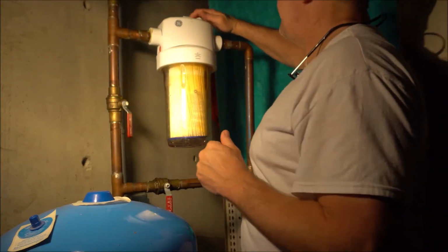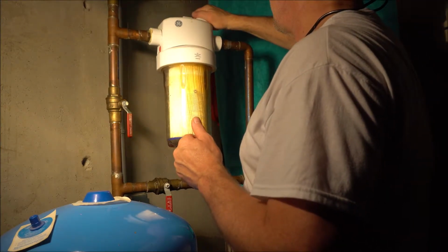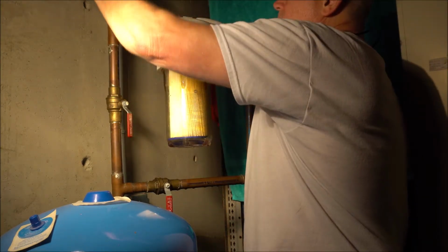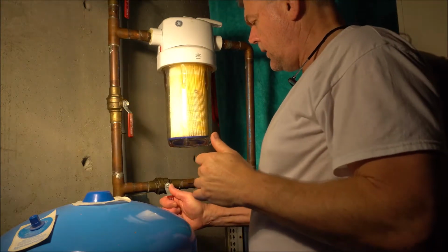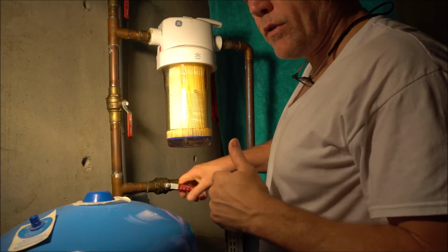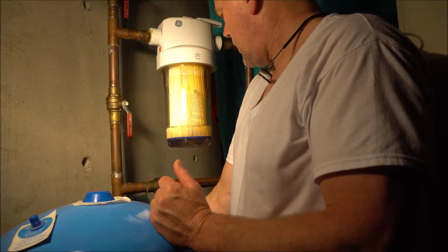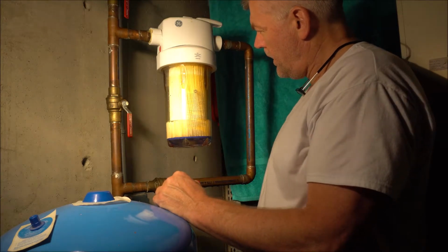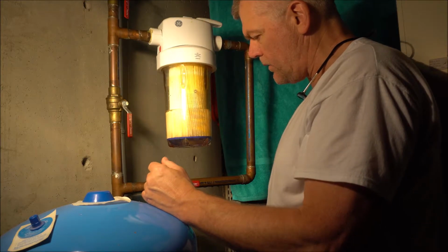All right, now I've got to make sure that we straighten out all the devices here, and then usually what I'll do is, as you can see, water's already coming in. So I'll turn on all the taps. See, I just turn on a little bit there, but that's just the stuff in the air. I haven't turned the main on yet. Once I turn the main on, I want to go slow, just to make sure. See how it's filling up? Usually when I get up to that point, if there are any leaks, they're going to happen as soon as this fills up.